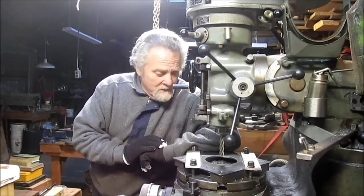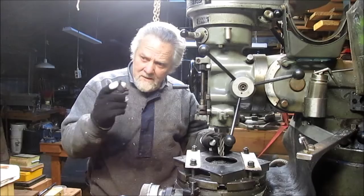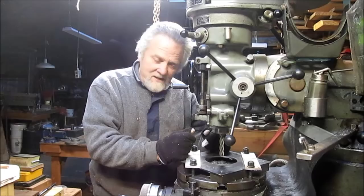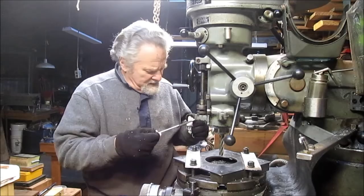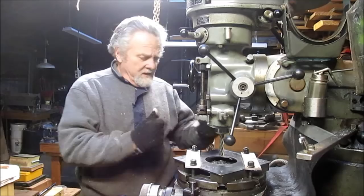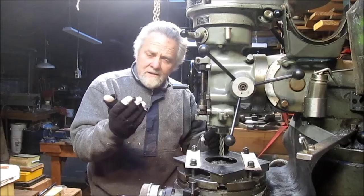So what we need to do is cut reliefs for the bolts that are holding the ram together, and I measured them, and it's 5/8, so I've got a 5/8 mill here. I'm going to take it just a little bit wider than 5/8, but 5/8 by, we're going to go in almost an inch, and that's going to happen in four segments. Yeah, it'll be fine. So, let's just get started. Okay, stick with me. We're going to have some fun.